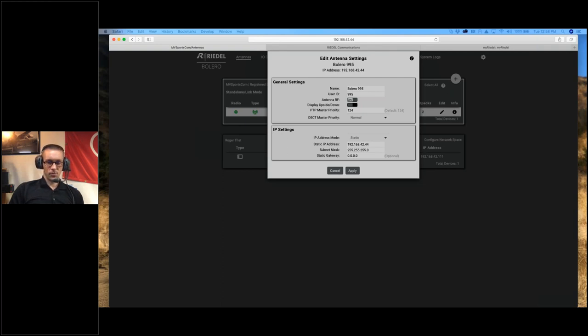But I really caution everybody: as we start getting into this 2110 stuff, you need to look at something with boundary clock. Transparent clock is fine, but really be looking at things with boundary clock as we move forward, as we build out these larger systems that we're talking about here today.